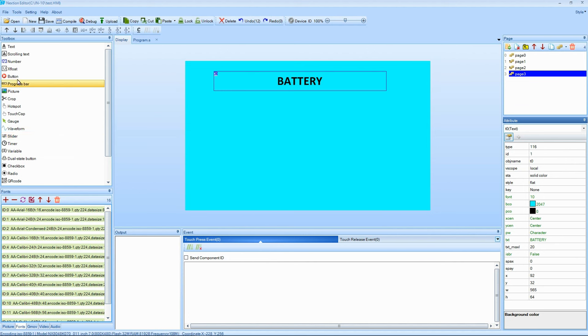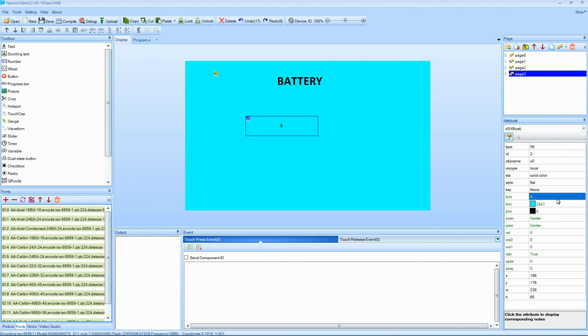Now, this next one's a little different. The other pages are going to be select. The buttons there are going to be selected, and they're going to be sending serial data out to the PIC to switch relays on and off. This display is going to be bringing serial data in, and I need to display a number that the PIC is going to be sending into this one for the battery voltage. So I have to pick something. It's called an X float. It's a floating decimal point number place, and I need that designated number that's on that icon to write into the PIC code later.